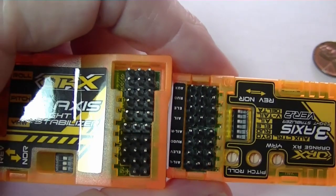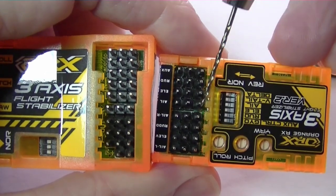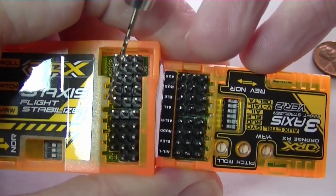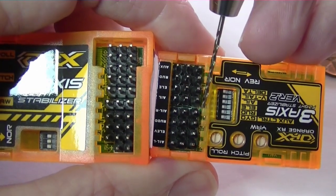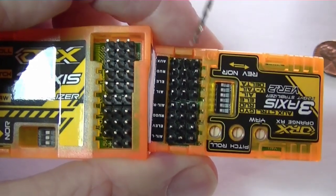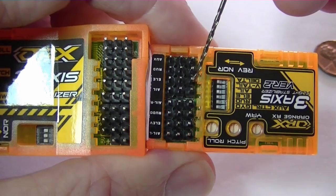Keep in mind where your signal wire goes — the light-colored wire goes where these notches are on both of them. That's because if you have a Futaba connector on your cable, the little tag on it would go into this notch. So Futaba wires automatically go in the right way, and for others you just have to make sure the white or light yellow wire is going to the signal pin.